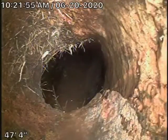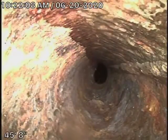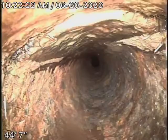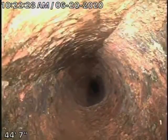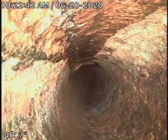You can see the cast iron is definitely getting very old as we pull the camera back — this cast iron pipe coming up the embankment on the side of the house. It's got minor little roots coming in through the coupling there. This cast iron is getting extremely old. Right over here, at the top of the screen, you see it's cracked and some roots are getting in at 12 o'clock — that's actually the bottom of the pipe.